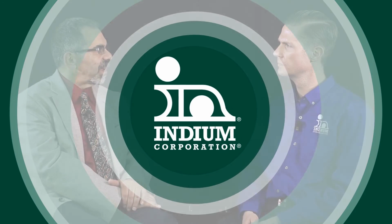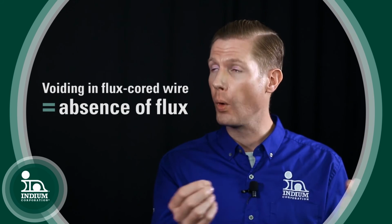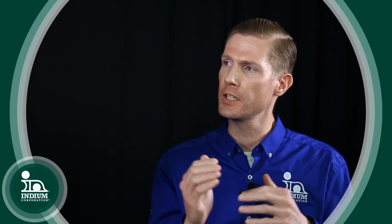Eric, we talk about voiding in soldering. What about voids with regard to wire solder? Phil, that's a really good question because it's important to distinguish between the two. Normally when you talk about voiding, one is thinking about voiding in the resulting solder joint. But when you talk about flux-cored wire, you're actually talking about an absence of flux, a void in the core of the wire. It's important for people to keep that in mind, because most of the time we're going to be talking about voids in the wire itself, not necessarily in the resulting solder joint.